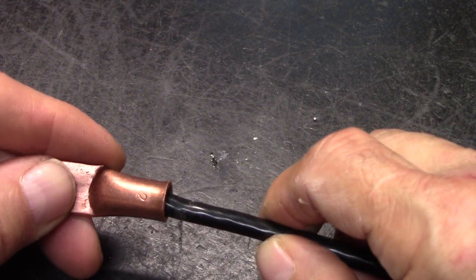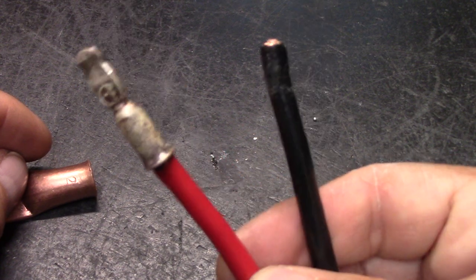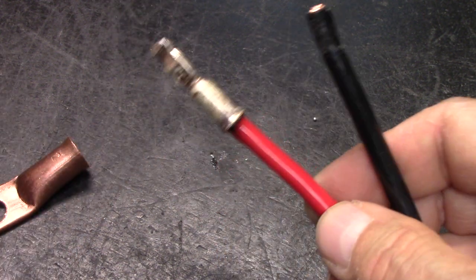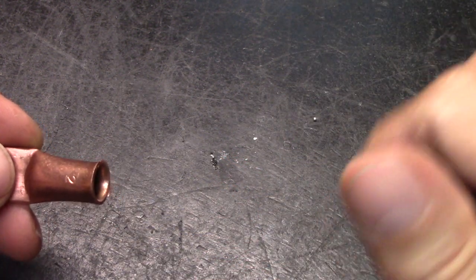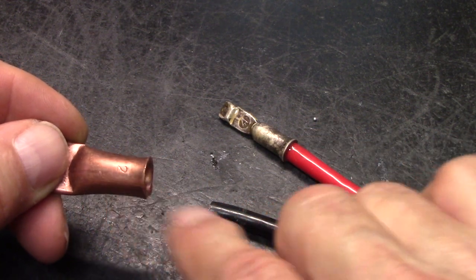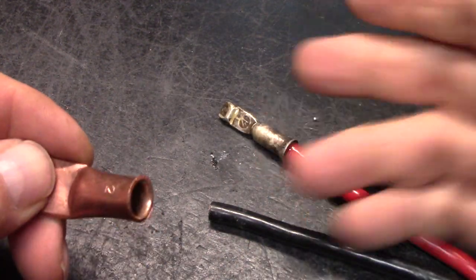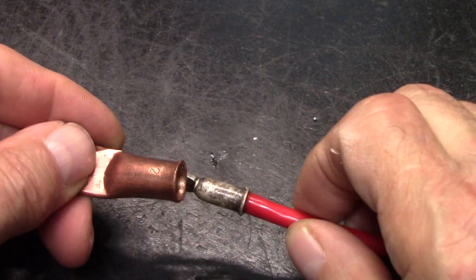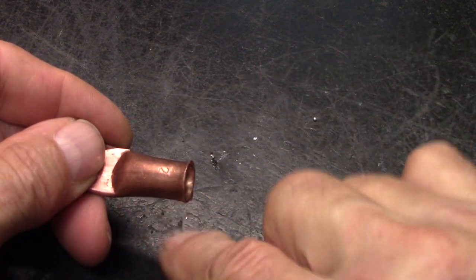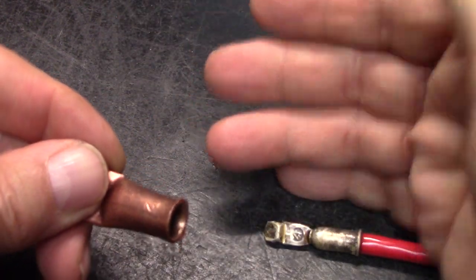If this ground, the main grounds to your amplifier, have any shitty connections or not done exactly or better, and I don't know of any better way of doing that, I think I covered it all, then your SWR is going to look fine when you key the mic if you have a meter in line. But as you begin to modulate and draw more current, that's changing the resistance to your ground. That ground is what is going to change now between your RF and DC potentials. So even though you see 50 ohms, if you got 60 ohms now, say 100 ohms difference in resistance when you're drawing 500 amps through this damn thing, that equation would be pretty trippy to explain to what your antenna now sees. It's the same ground.